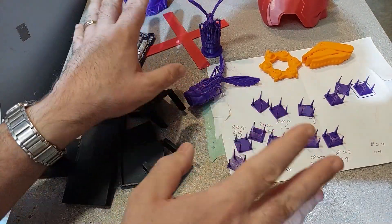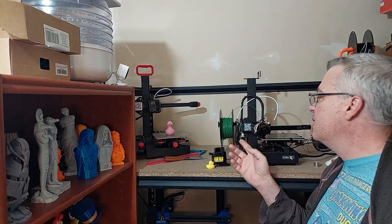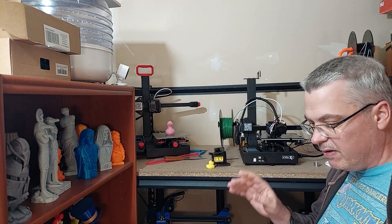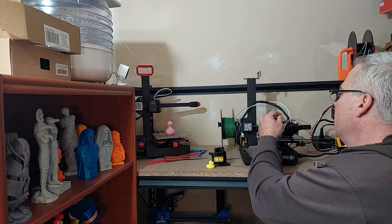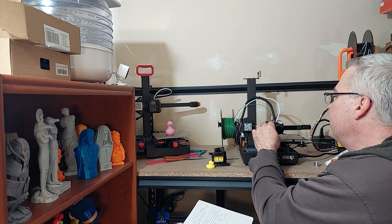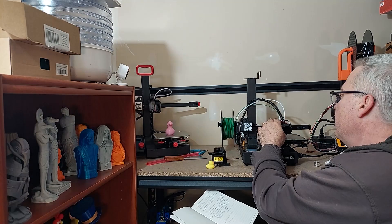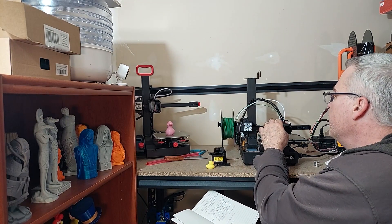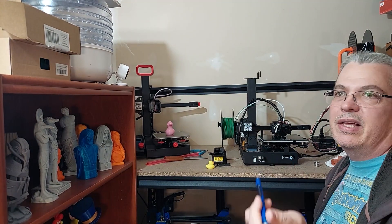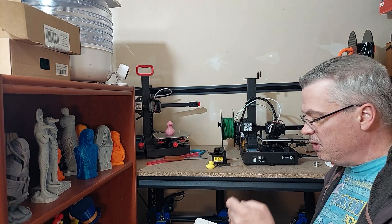Overall it did a really good job. Here's the BQ extruder done on my Tronxy Crux. A couple of notes on wiring — just follow your old wires back and make sure you plug them into the right spots. That's why I left the fans the same, because Tronxys are sometimes backwards with their wiring. I'll leave links down below for all the mounts and fans and stuff — I think I got them off of Thingiverse. You can go down in the description and grab those if you want.